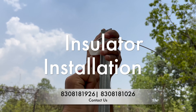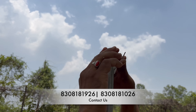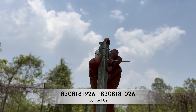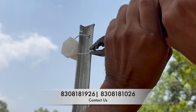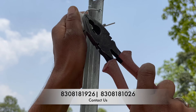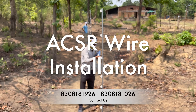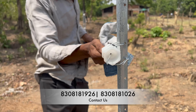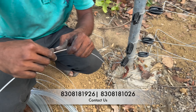After that, you start the installation of the remaining three reel insulators. You put one laborer behind the pole-installation team so that this work is also done very fast. Tying the insulators at height is a tedious job, which is why we do the first five insulators at ground level where it can be done quickly. Now we start installing the ACSR high tensile wire — all you have to do is find the hole in the reel insulator, thread the wire through it, and at the end tie it off at the corner insulators.